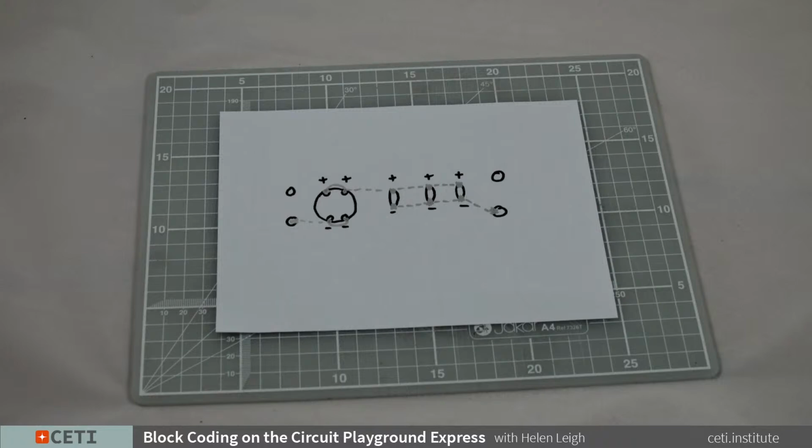That's it, that first one. I would go twice, just to make sure it's nice and secure. There's 2 holes for ground, and that was the negative. There's 2 holes for ground, 1 hole for on. It's kind of a weird silk screen, normally we're 3 holes for ground, and on. So we don't need on, or we do need on? Yeah, so 1 is ground here, so ground goes to that snap.